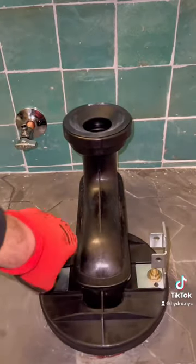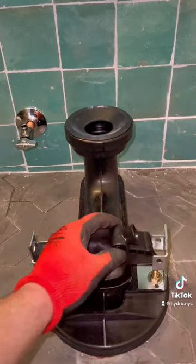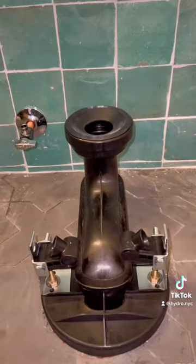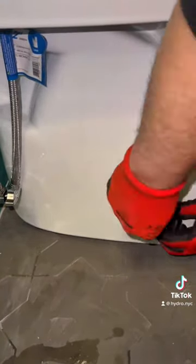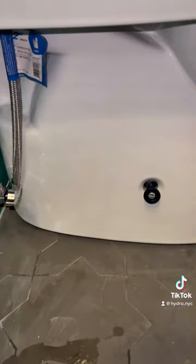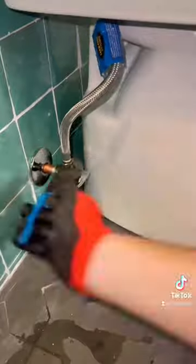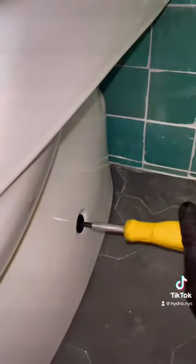First thing I check the instructions, just in case, because last time I installed one of these was like 3 years ago. Put the johnny bolts, wax gasket and the trap rough-in and tighten it with the brackets that mount the toilet. The toilet went in with a couple of wiggles and that was it basically. The hardest part was tightening this screw and it's not even Kohler's fault — I grabbed a screwdriver I had used as a chisel and that flathead was destroyed. After the mounting screws are in, I connect the water, flushed it a couple of times, and bam broski, all done.